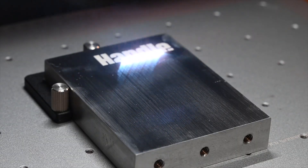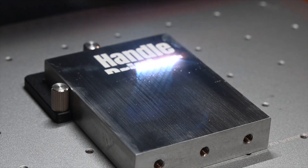Now there are several different kinds of lasers, but in the price range for more small-scale, non-industrial uses, you've basically got two main types: diodes and fiber lasers, which is what the F2 Ultra is. Fiber lasers generate the light in a slightly different way from diode lasers. Typically, fiber lasers use a lens and mirrors to aim and focus the laser, whereas diode lasers typically use a gantry system — think like a 3D printer, where the laser unit is attached to a gantry that moves it around physically. So the fiber laser is stationary with fewer moving parts and can go pretty fast, whereas diode lasers are limited by how fast you can move the gantry without shaking it to pieces.